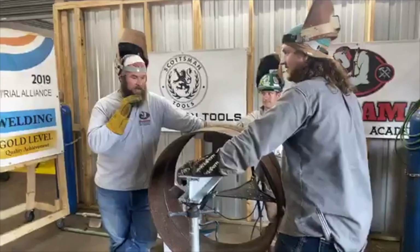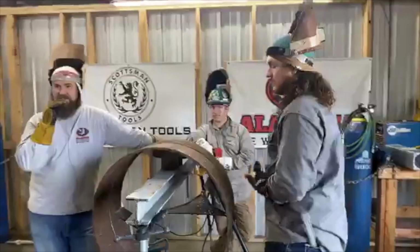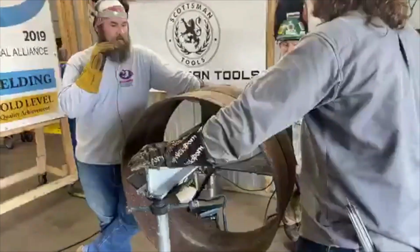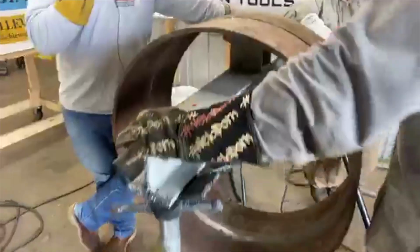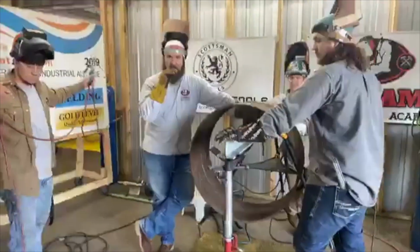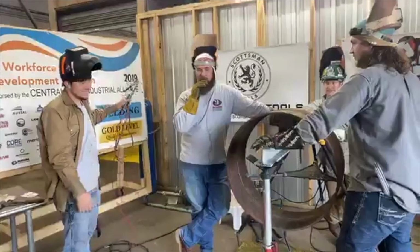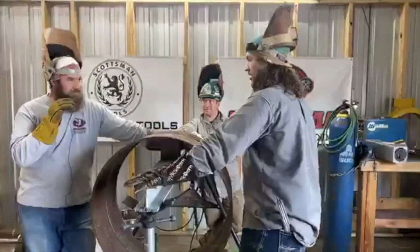All right, so we're about to do this 30-inch downhill 1104. We're doing eighth-inch 6010s. I'm going to start off on the bottom. Austin's going to start at the top. We got two helpers here that have never been a helper before, so you're going to have to cut us some slack. Probably be a lot of yelling.